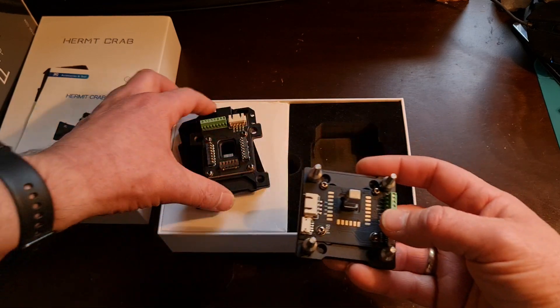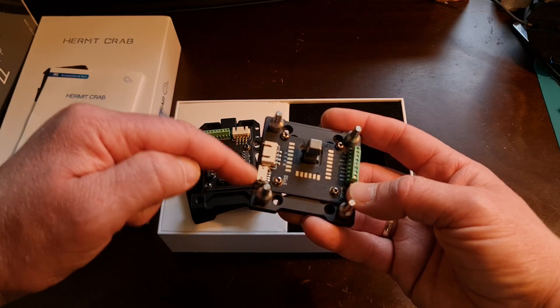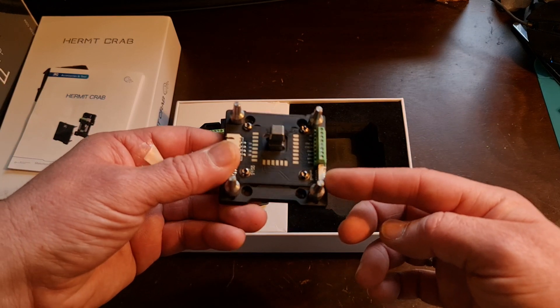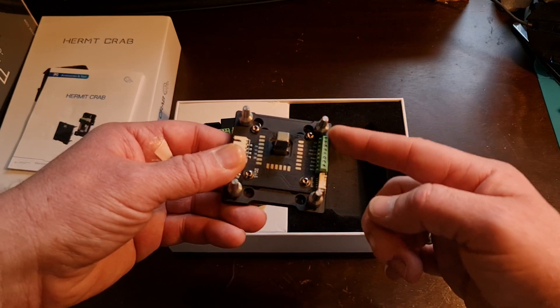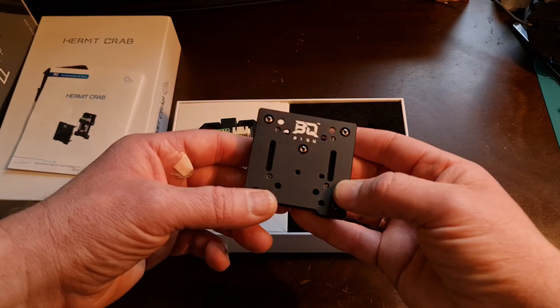There are matching plugins on the tool plate as well. You have your stepper motor, end stops for various types with plus and minus, and two different sense pins. On this side you have your BL Touch style or probe sensor — your servo and Z-min setup, all five pins are in there. And then your fans, heaters, and temperature sensors. So everything you need to get going.